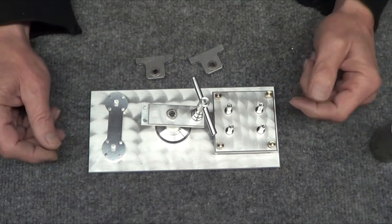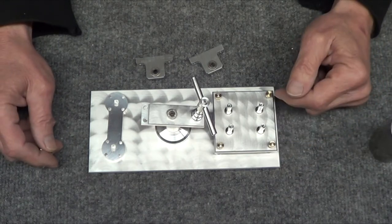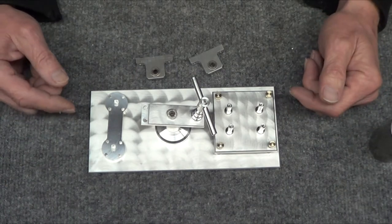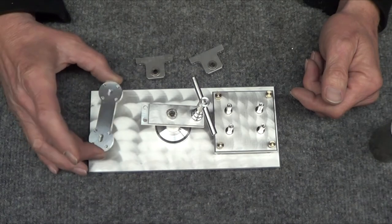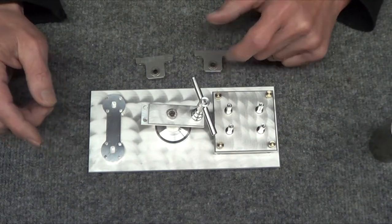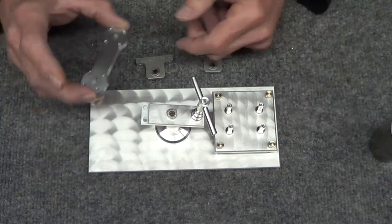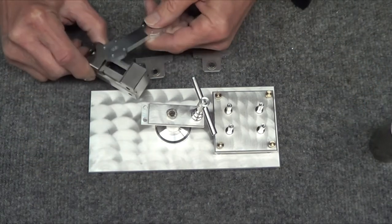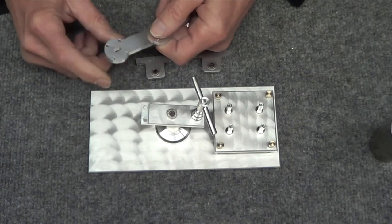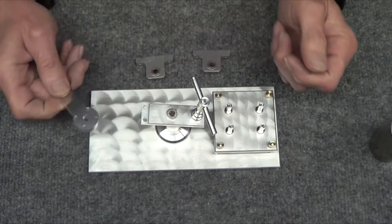So when I get the XY table, I'll show some stuff and try to experiment with making these, finishing these guys off for a spanner, which I think will look good. This guy, when I was machining it, I mean, this whole project is fantastic because it's a big time learning curve, challenge, everything. To finish this guy off, all of a sudden I was having a problem trying to clamp it, and I figured, oh, just put it in your little vise and then clamp this down to the rotary table, and you can easily do this and the other side. So rebuilding this is going to be quick and not a problem to do.